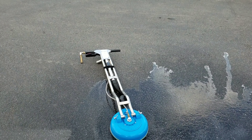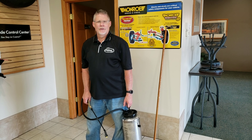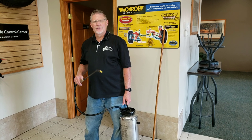Clean as a whistle. I'm going to show you how we're going to lay down the Sager super sealer. This is a ceramic tile grout. Some of you are going to say, what's he doing applying it on the ceramic? This is not a wax — what this is is a fluorochemical penetrating solvent-based product.